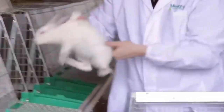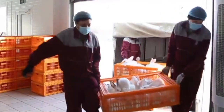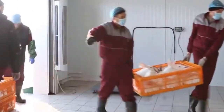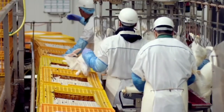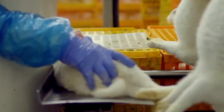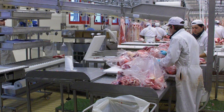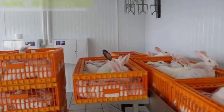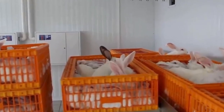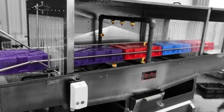Semi-automatic line: This solution, being a semi-automatic system, is ideal for small production capacity plants. A stack of crates is loaded onto the lift, which aligns the crate on top with the roller conveyor. An operator slides the crate on the roller conveyor, while the lift automatically aligns the following crate, and so on. Operators' job is therefore safer and lighter because they don't have to lift crates one by one anymore. Crates running on the roller conveyor reach the shackling area where operators empty the crate, which then moves towards an automatic crate washer. At the exit, another operator stacks washed crates to be reused for animal transport.